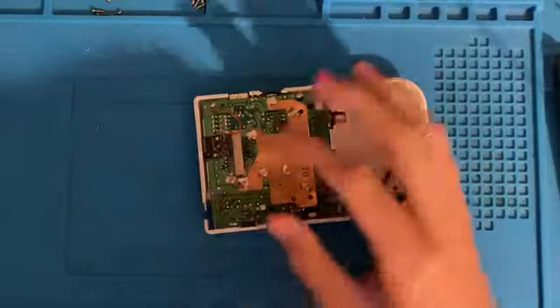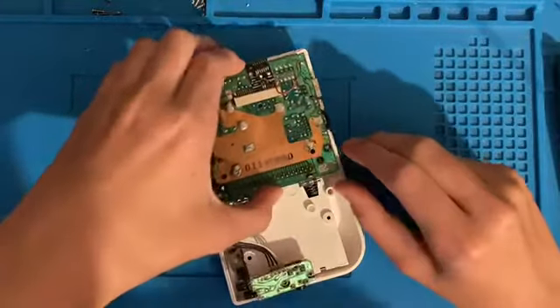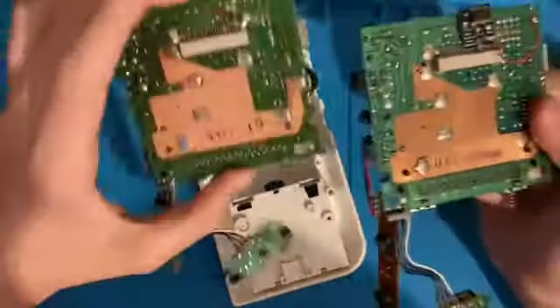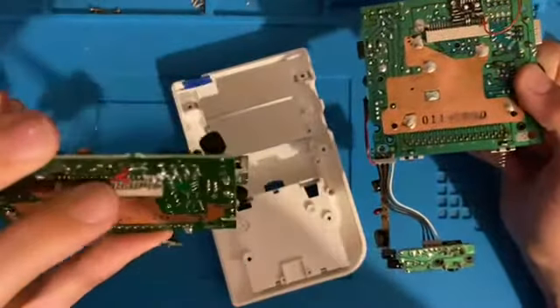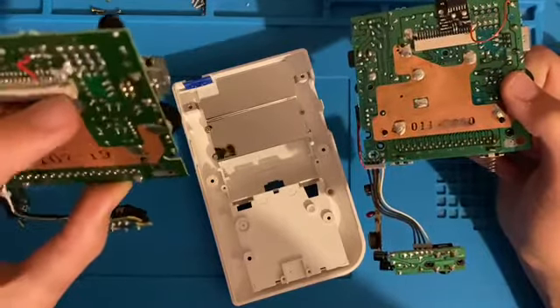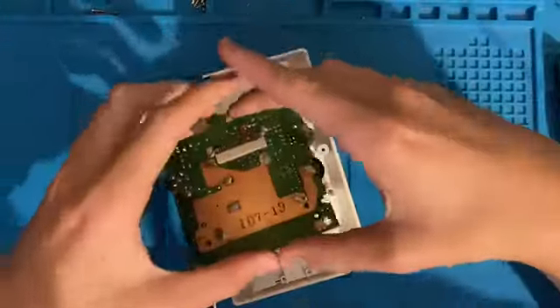What I'm going to do is actually keep this Game Boy for myself, and I'm going to change it to an un-biverted board. I'm not going to remove the bivert chip off this board and risk damaging it — I'm just going to swap this board over. I have this other one. This one has had some repair work done to it by me. It did have a bivert chip on it but it was removed, and one of the traces was damaged, and the ground pad got a bit damaged too. But it works. I'm going to save this other board for another video — at some point I will backlight another Game Boy and bivert it.